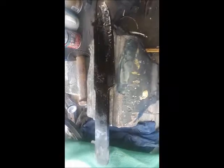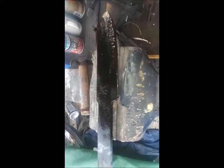We've got ourselves a hardened blade. At this stage, it is in a very hardened, brittle stage. What could happen is if you were to drop this on a hard surface, it could break — I know this for a fact because I've done it once. I also once saw a small bend in the handle and tried to bend it in my vice while it was in this hardened stage, and that sucker just snapped.